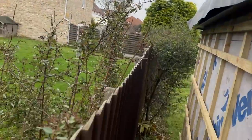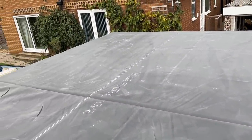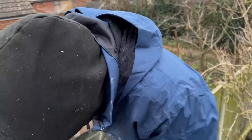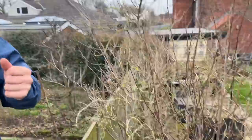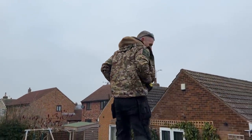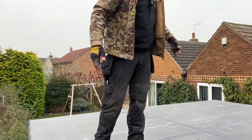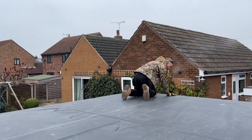Right, there's the rubber. Like I say, we've left it there and the creases haven't come out — it's just this time of year. Aesthetically it's the only issue; it has no impact whatsoever on the tightness of the building. So Davey's going to get himself into position. Now what you want to do is determine which side you want to glue from. What I normally do is glue front to back, and then when we get to the back, especially on a square build like this, we can do that — or if it's a longer build say four or five meters I'll do side to side.